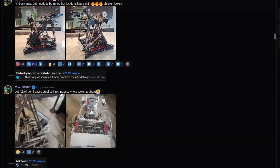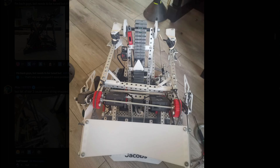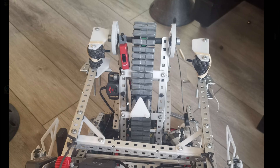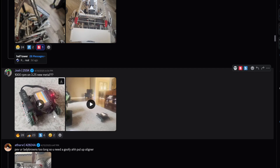You'd want to fix that. You had steel string and it still snapped — maybe look into ultra high molecular weight poly string or something similar on Amazon. We had that and it worked pretty flawlessly and never snapped — that's also what Echo uses, so maybe ask them. Interestingly, you have a limit switch here — so you have a color sensor to determine the color of the ring, and the limit switch is for timing. Instead of calculating the timing yourself, when the ring hits the switch at the very top you know exactly when it gets there. That's nice, but I'm gonna give this one a solid B tier.